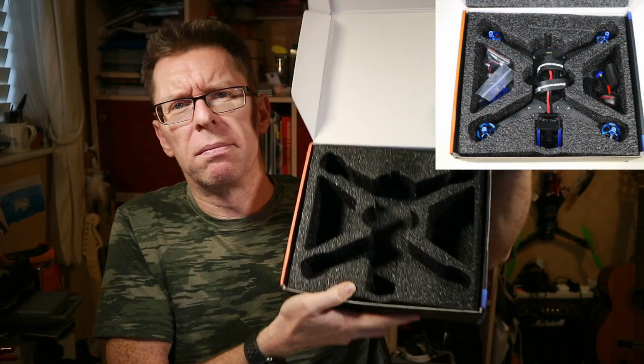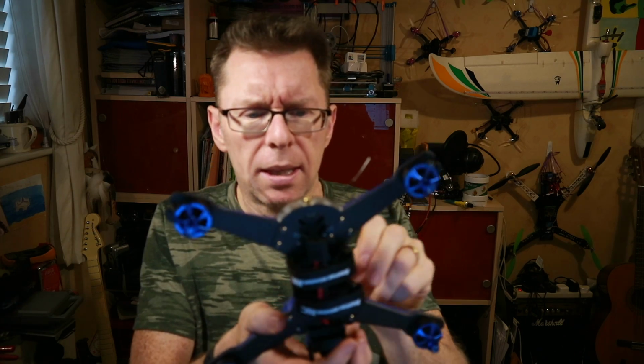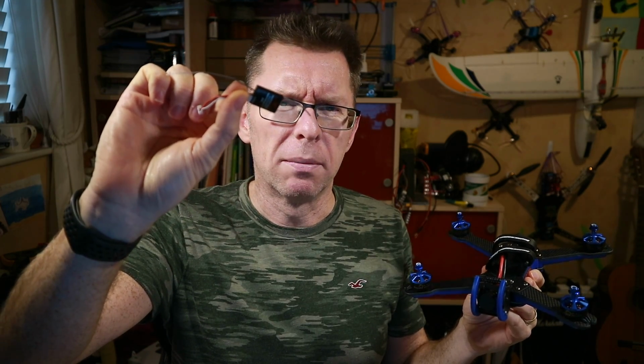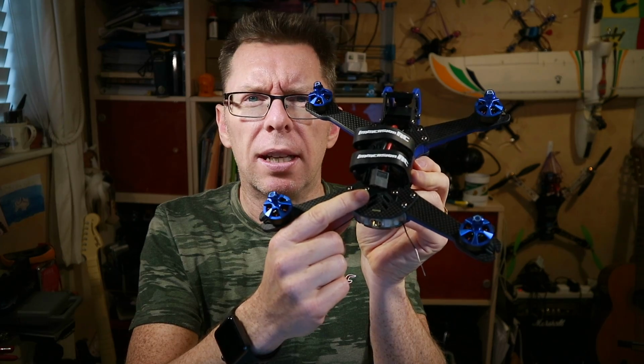It comes in this lovely moulded box, of which I've already got it out, and it looks like this, which is gorgeous. Yeah, so this had this SPM 4648 Spektrum receiver. I've swapped this out for a FrSky XSR. Why an XSR? Nobody ever uses those, do they? The XSR was basically a kind of depinned X4R with just a single little connector instead of servo leads.